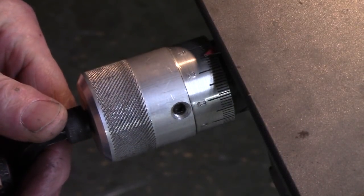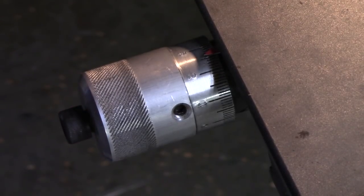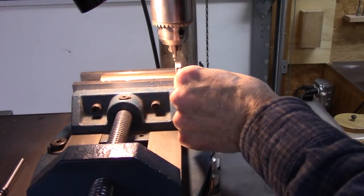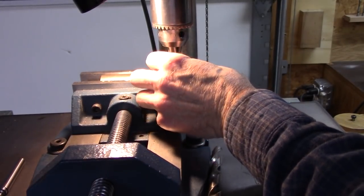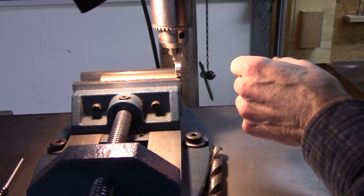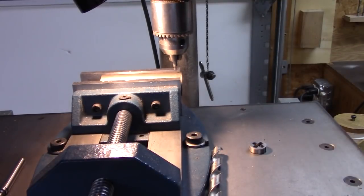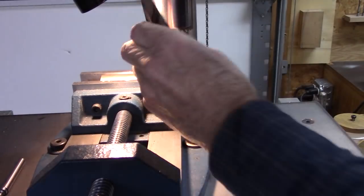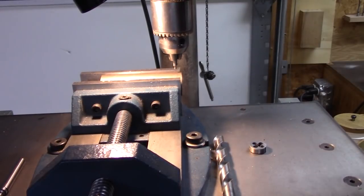At 25, that should be the center of inch and a quarter. I want to drill my relief holes behind this die — these will be the holes to relieve the chips. That's lined up with the back of the die. I'm going to drill a half inch hole behind the die, so I want to go half of a half inch, which is one quarter inch further. That's 250 thousandths.